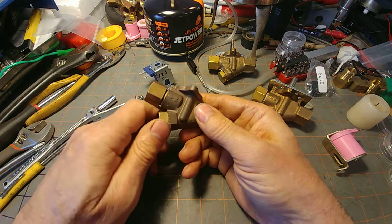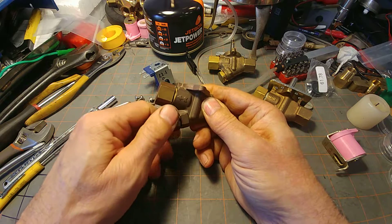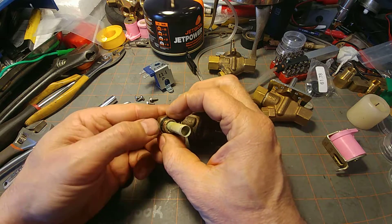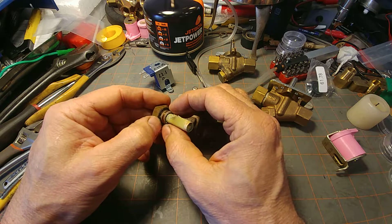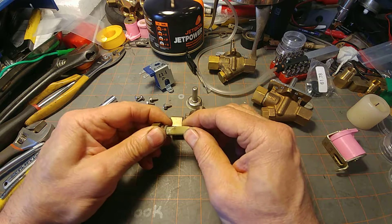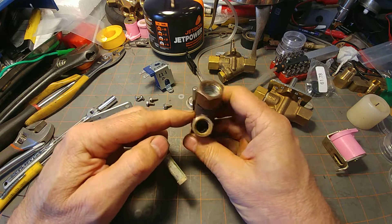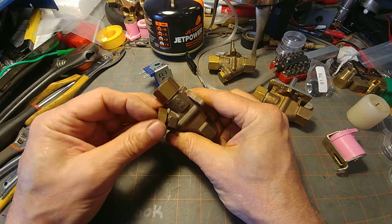This is the strainer here — this is a three-quarter inch drive. This comes apart, and you can see there's an o-ring here which is pretty easy to score up, so be careful with that. This is the strainer which can be taken out and dipped in a vinegar solution. You can see there's some buildup there; the whole thing can be dropped in a pickling solution.